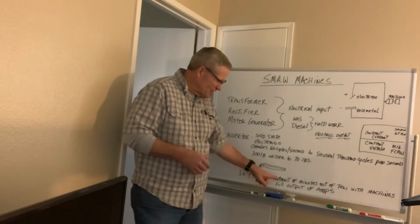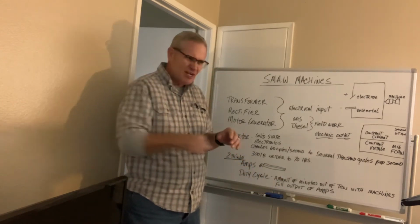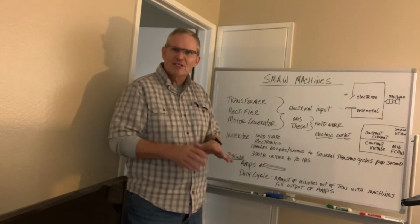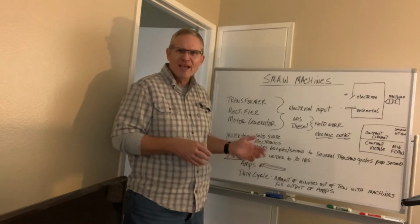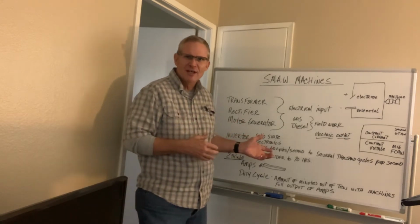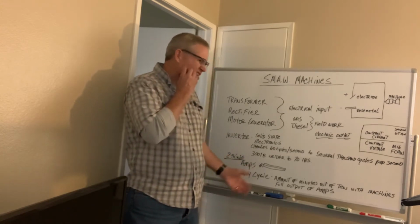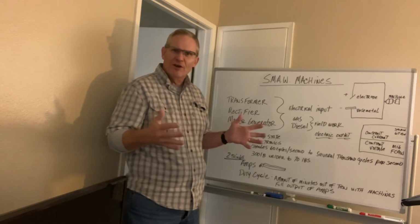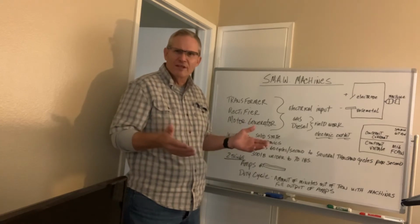And what I'm trying to suggest to you is that you can't chip the welds fast enough. You can't chip them fast enough. You can't clean them fast enough. The whole time while you're assembling plates gives that machine time to cool down. And that's how you utilize these duty cycles to your best interest. And having a machine where you can run it consistently and have the duty cycle not interfere, that's about what you want to purchase for whatever type of welding that you want to do.